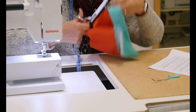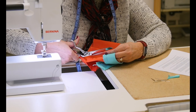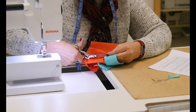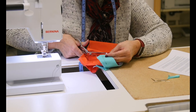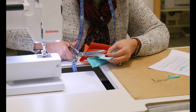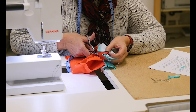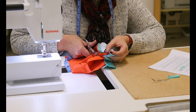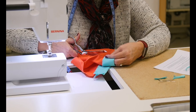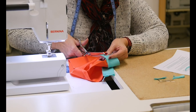And then on this side, this is the facing side, so the facing will be a fourth. So I'm going to take off another eighth of an inch there. Now I'm going to trim this side to three eighths — that means I take off a quarter — and then go to the facing side and take off another eighth, so that this will be a quarter and the other side is three eighths.